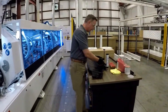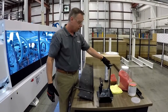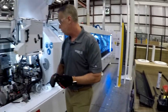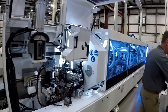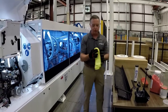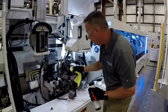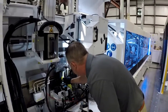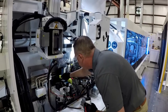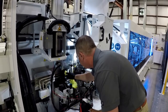Here on the table, I've already got laid out our glue tray, a scraper, some glue, our cleaning agent, and the other things we're going to use to do this. The next thing I'm going to do is get some grease on the side of the glue unit here, just to make sure that if we get any glue there, it's going to clean up nice and easily. You want to be careful when you're doing this because it is hot — that's why we have gloves.